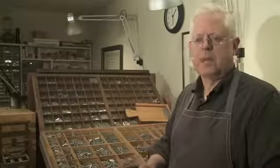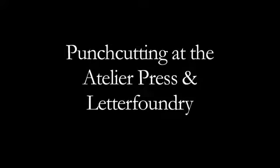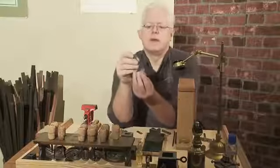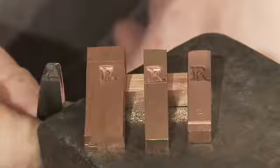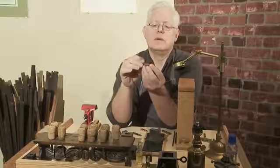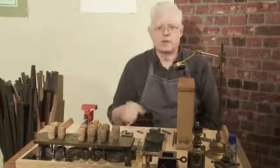The cutting of a punch, making of a matrix, the casting of the type, finishing the type, and so forth. For every letter there had to be an original, in this case a steel punch. The punch is driven into copper. It makes an impression in the copper and this is then filed and made into the matrix, level and ready for the mold. So we're going to go through this whole process of making a punch and striking a matrix.